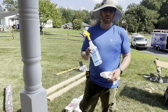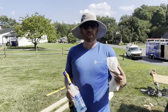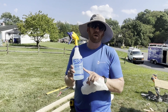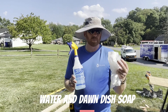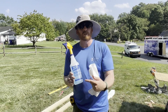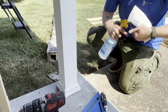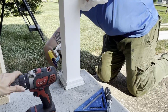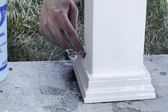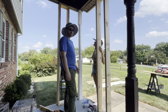Here's a little trick when you're caulking. To get the clean look you're hoping for, you don't just want to caulk and spread it with your finger. There are caulking tools you can use. In this case, because it's so small, I'll use my finger, but I'll spray it with a mixture of water and Dawn dish soap. Spraying it makes it smooth so when you're pulling it, it's not getting all clumpy — rather it's a smooth line. Always use this trick.